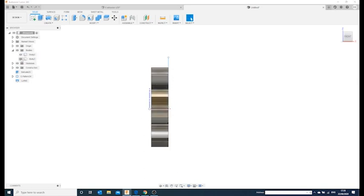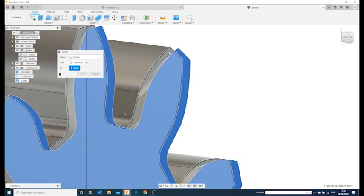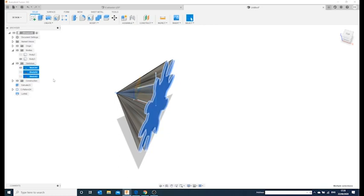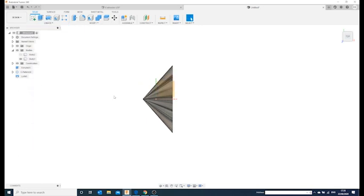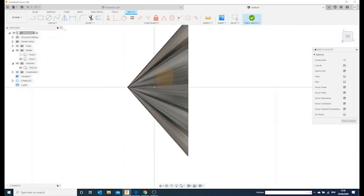That was my original gear; this is my new beveled gear. Using Move/Align, I'll push it back that extra millimeter to align the face of the new gear with the face of the original, then click OK. The new gear is now in place where the original was. I'll tidy up by deleting sketches and then prepare to create a second gear that meshes with this one.